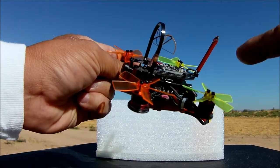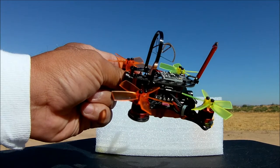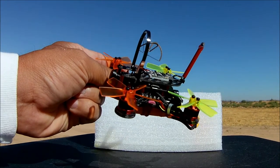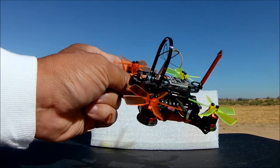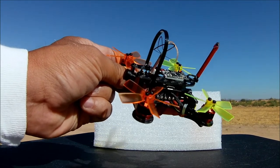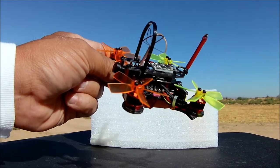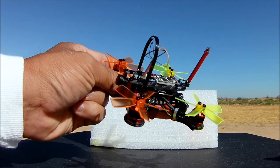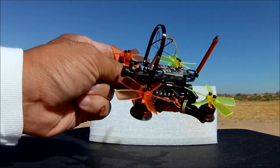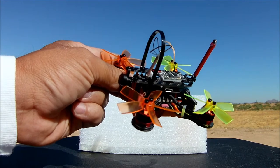Sometimes what happens — on one of my other quadcopters, I think it was the ASUAV Q95 — when I went back in to change the PIDs, it ran into a glitch and everything was messed up. The receiver tab would show all zeros. So I had to do a reset and put in all the parameter values again. After I disconnected and saved everything and went back in, it messed up again. There's some kind of issue going on with the new Betaflight firmware and some of these Pico BLX firmware boards. Anyway, if you come across that problem, go to the configuration page, hit reset, and start all over.